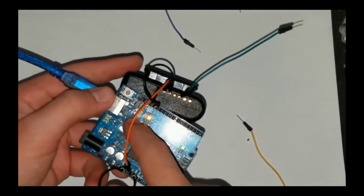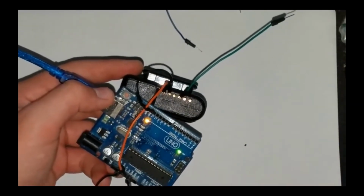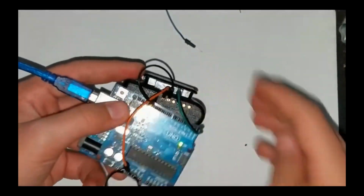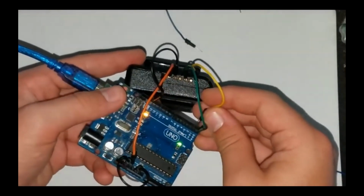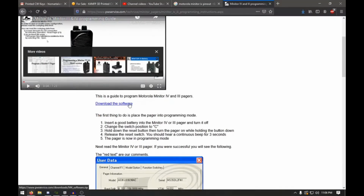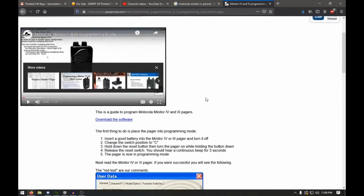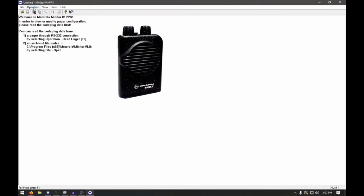In the program, define the communication channel and address for sending and receiving messages. One Arduino will act as the transmitter, while the other will act as the receiver. When you press a button on the transmitter, a signal will be sent through the radio module to the receiver, where the LED will light up, indicating that a message has been received. You can even add more complexity to the code by programming different buttons to send different types of messages or integrate an LCD to display text information.